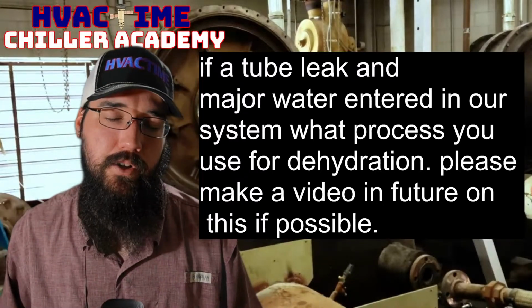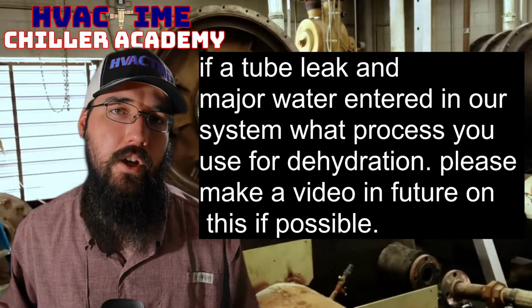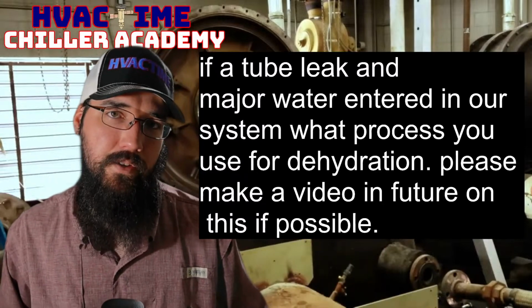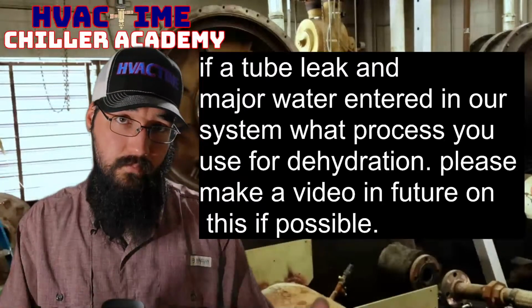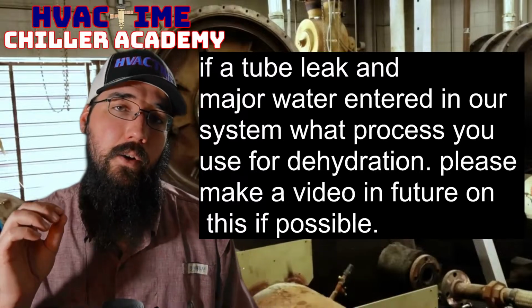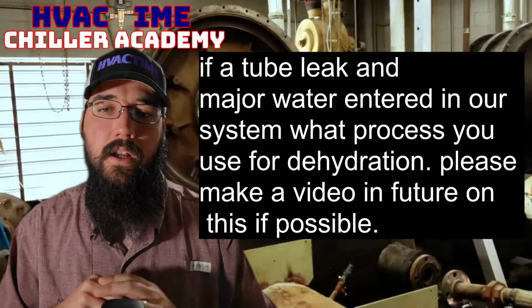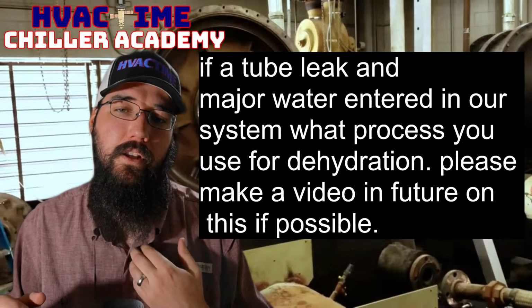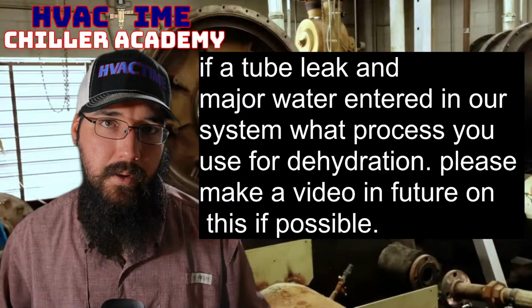So now we're talking about, say, a low pressure machine. Because if it was a high pressure, you would just be losing refrigerant, and you'd notice you have a low charge one day. You'd pull the end bells off, do some leak searching. Okay, we found this particular tube is the one leaking, but water hadn't made it into the chiller. If you have a low pressure, though, that water is going to start seeping in. Now, let's say this happened at a very small scale and you had that tube leak. It wasn't severe, but I noticed you did say major water leak. Okay, so if we're talking major, you're talking a retube and probably an overhaul.